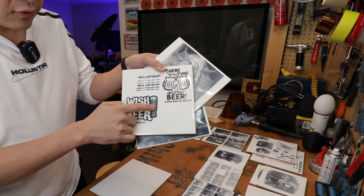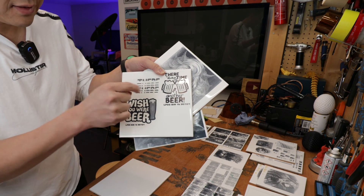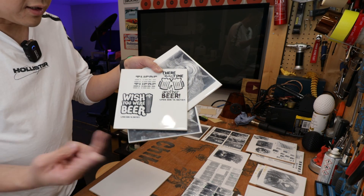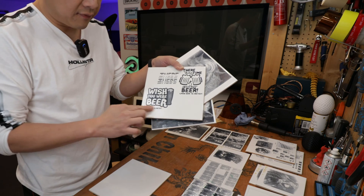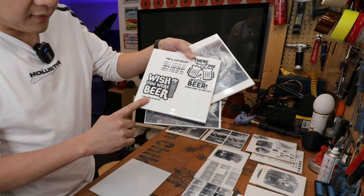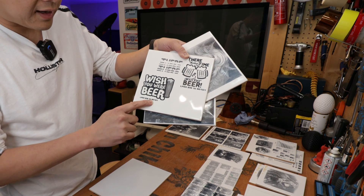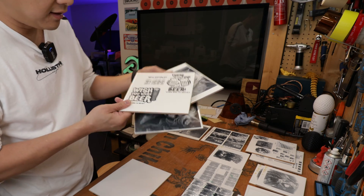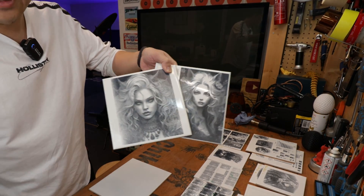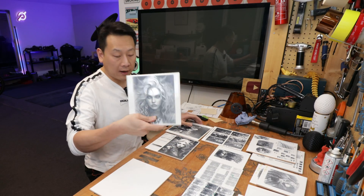This part is where I use the dot matrix kind of print — the laser fires individual dots. The closer the dot, the darker the shading. So there are two types of function available. The setting I use here is a beam function at 1K resolution, 90 power, 10 speed, and only one pass. It's already kind of better than my previous laser — a lot more detailed. Those are just sample pictures I found online.